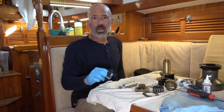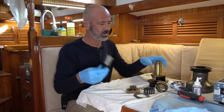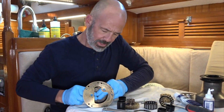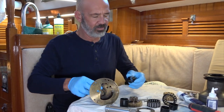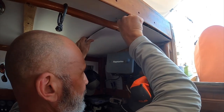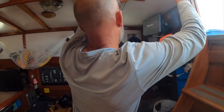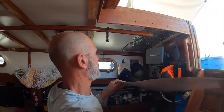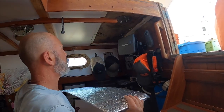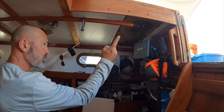After another week I got the main shaft bushings delivered — these are the ones that melted. It takes two of them to fit up inside, so I got a couple of spares as well. These get pushed in from the bottom and go all the way up; there's a shoulder that stops them from going any further, and that's what the main shaft gear spins on.